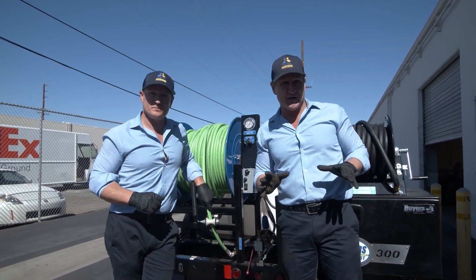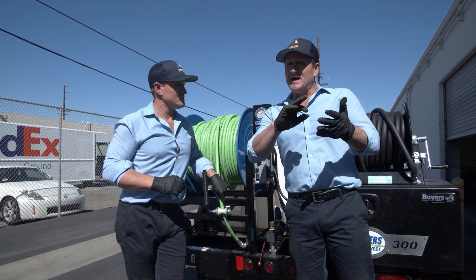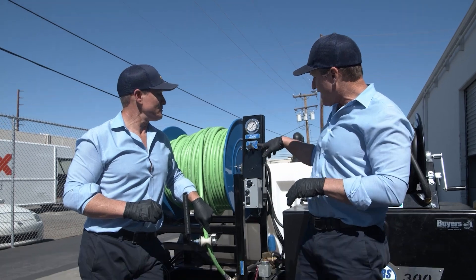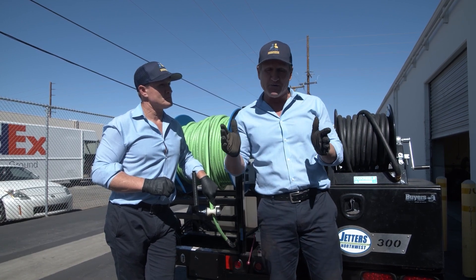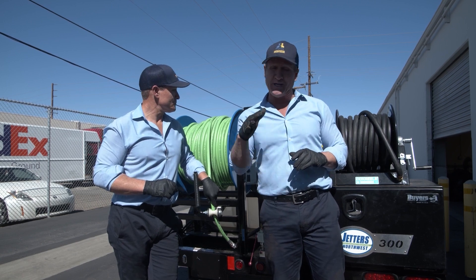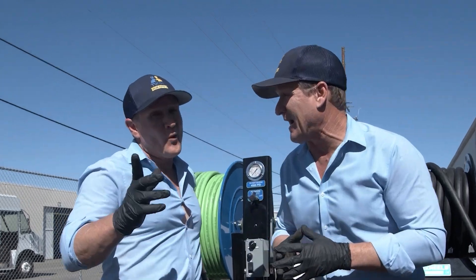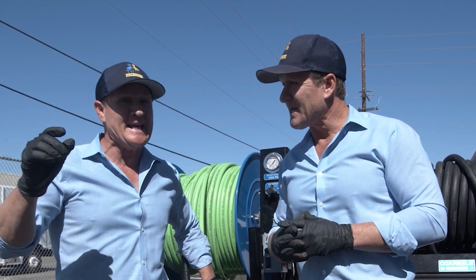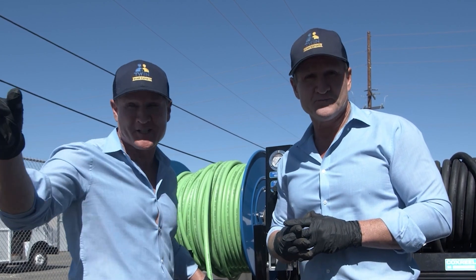This is a trailer hydrojetter, widely used across the United States for removing roots and descaling. This unit is rated at about 4,000 PSI. You want a jetter operating in the 3,000 to 4,000 PSI range — that's the only PSI range that will really maximize the use of high-tech nozzles. Anything lower and you won't get the deep cleaning you need. John also has a small cart jetter he says can attack a drain and get it much more clean than dealing with a big trailer jetter.